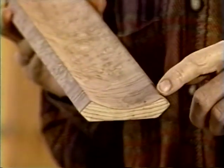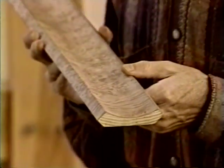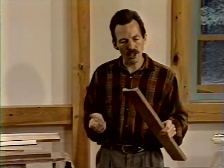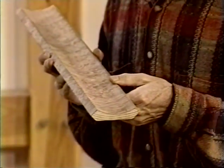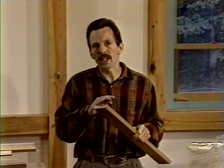The next topic I want to cover is veneering moldings, which requires bending veneer over right angles. I always get, how did you do that without cracking the veneer here? When people see this, it's not really that hard. In fact, with a few simple tricks, it's quite easy. Let's start with this cove molding. First, I want to say that only simple shapes can be done, like this cove, or at most an OG molding. A molding that has intricate detail is just plain too difficult.